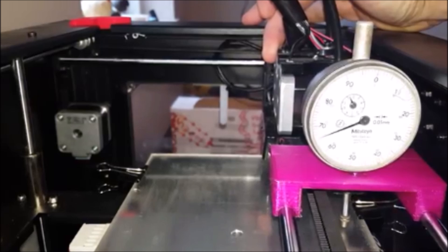At 0.3mm, if you're squeezing it really tight in the center, you're basically not hitting the bed out on the edges of the platform. So the bigger the build, the worse the quality. That was a real eye-opener for me.